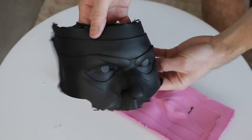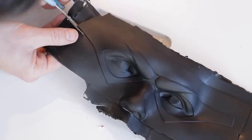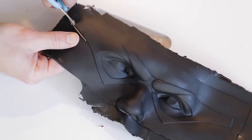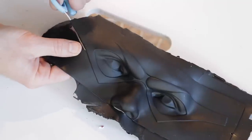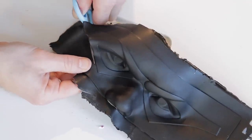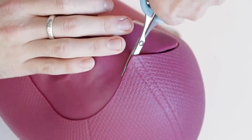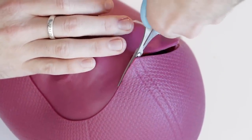It's such a brilliant urethane to work with - I definitely want to work with it more in the future. I do get a bit intimidated with urethane sometimes, but now that I've realized the F-series instead of the S-series - because the S-series is a slow set and you're going to be there until the cows have come home working with that - whereas the F-series is much faster. I'm just getting some small hobby trimming scissors and trimming everything up.